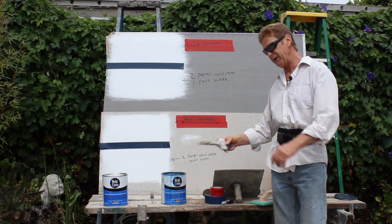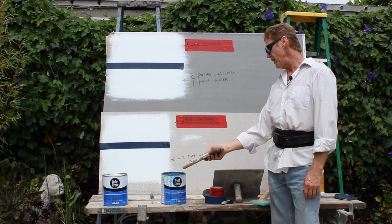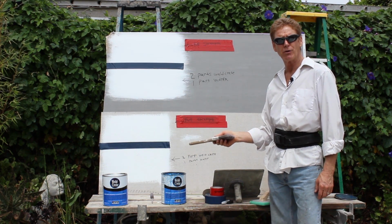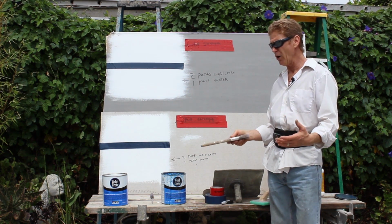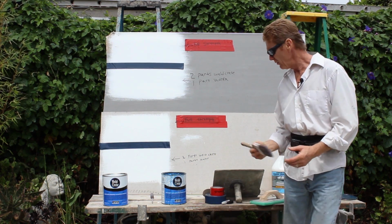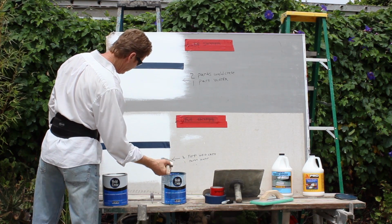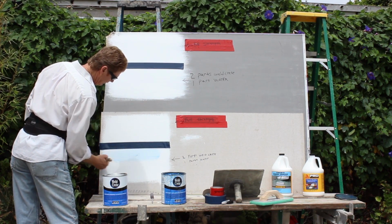I choose the Weld Crete, and I have been using it for over 30 years. Why? Because you can put this on, and within an hour you can apply your cement or your stucco or your color coat, and you can put it on for about 10 days. It will adhere. So what I'm going to do, guys, is start with a little bit of diluted stuff. Okay, we're going to do this bottom piece here.